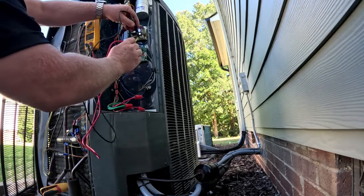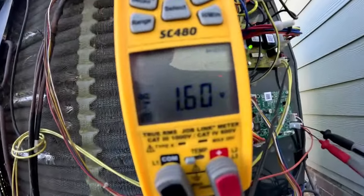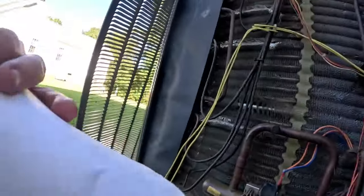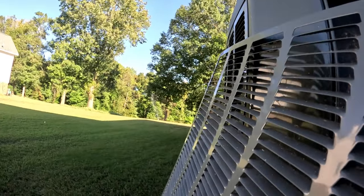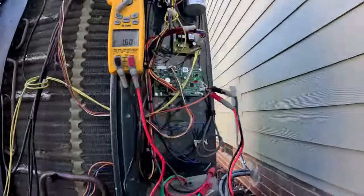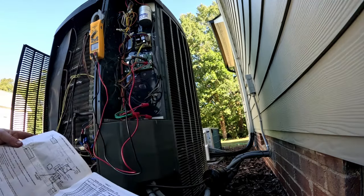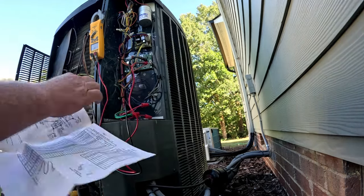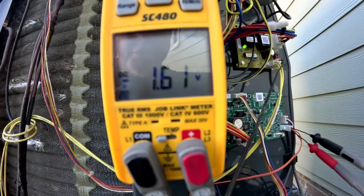We'll confirm that by getting another DC measurement. You can now see this is 1.6 volts DC instead of 0.26 volts. He's got the sprinklers going out here — it's like 68 degrees, we've had 12 inches of rain this month, and for whatever reason he feels like he needs to water his grass. Anyway, right there we're reading a temperature on that suction line of 69.5 degrees, which is basically 70 degrees — and at 70 degrees the chart shows 1.61 volts. We are at 1.6 volts.